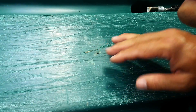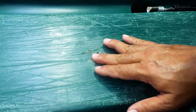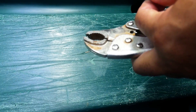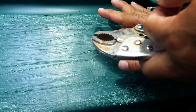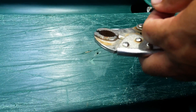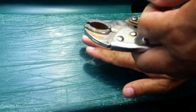What you're looking for is just a kind of a glaze on the base material, and then the secondary material you want to be very, very soft — almost not liquid. But when you put that very soft heated piece on, that heat is going to make the base even softer. That's why you don't want it already starting to compress — you want it less than that so when you add the extra heat, it's not going to concave on you.